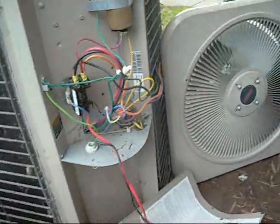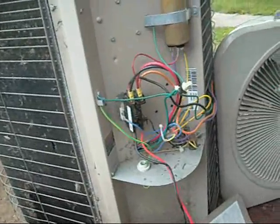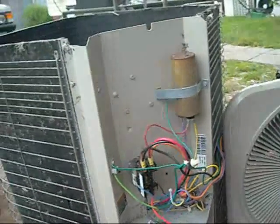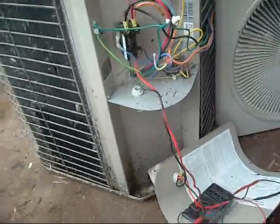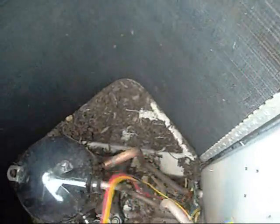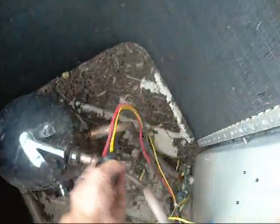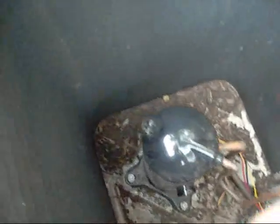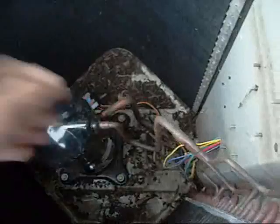OK, this thing looks pretty good. Compressor ohmed up just fine, fan motor ohmed up fine, nothing's going to ground. I kind of feel like Dr. Zarklov or Fritz HVAC working on this unit because I've never ever seen one in Australia before - I know they're around but I've never actually seen one in scrap or actually worked on one like this. It's all American stuff and this thing's full of compost. That's the only problem with updraft fans - if the unit's anywhere near trees or foliage it just ends up inside. It's got the special plug pack for the compressor. Very thin - it's only a single layer coil, not a twin layer, and it's cooling only as well - there's no reversing valve.